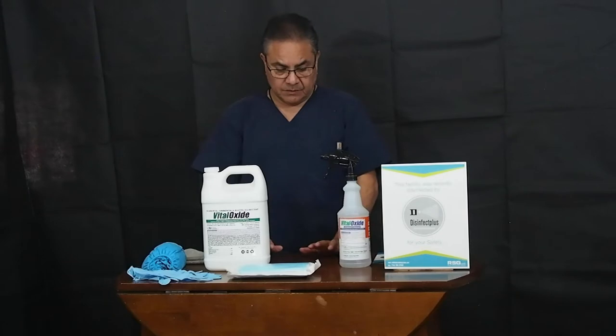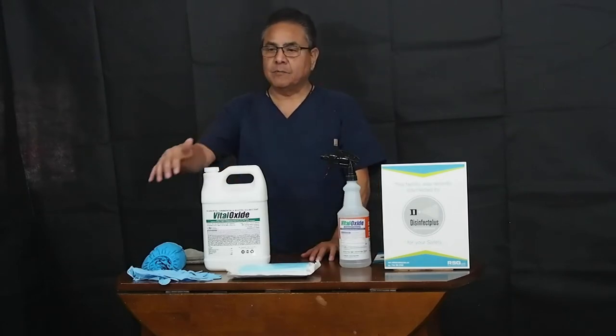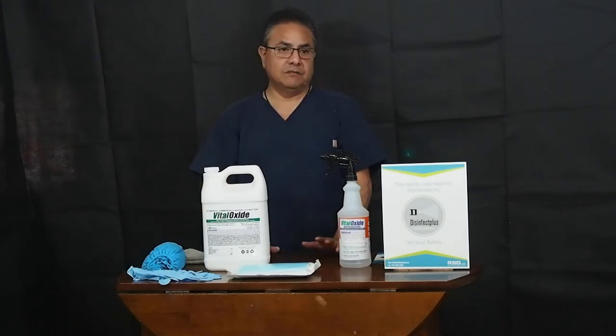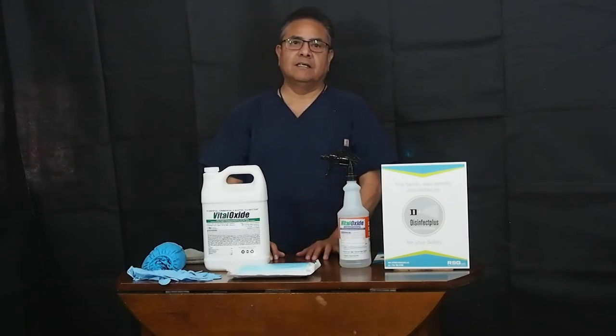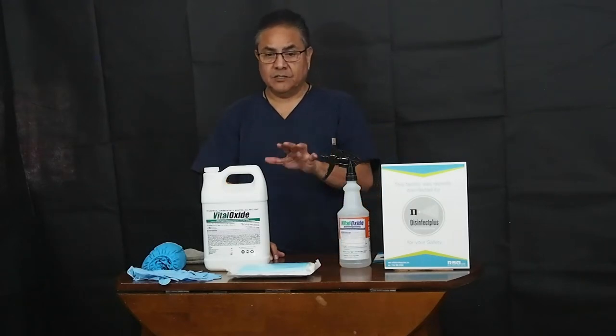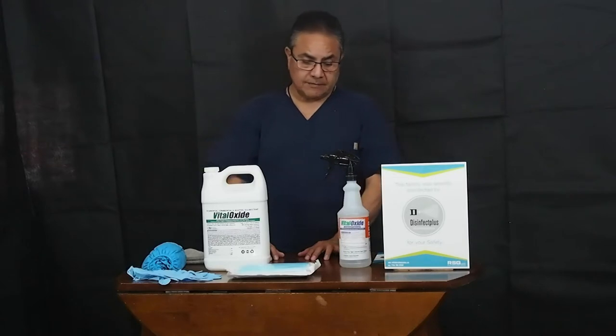Today we're going to learn about our product, Vital Oxide, proper PPE, current updated EPA regulation, application recommendations, and overall status of disinfectants. We're also going to learn about the use of fogging equipment, both electrostatic and cold fogging, and show you exactly the equipment that you're going to be using today. So let's jump right in.